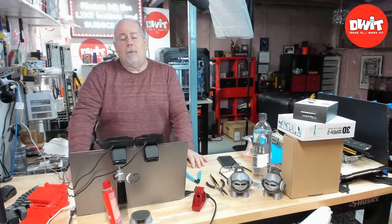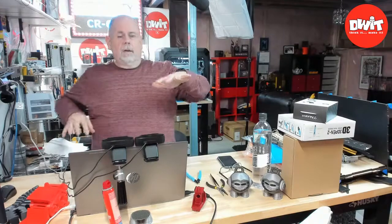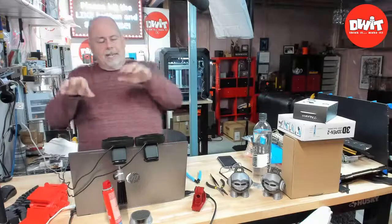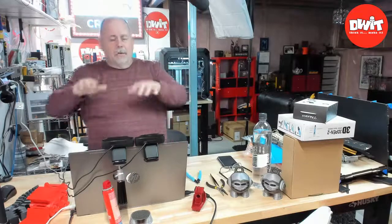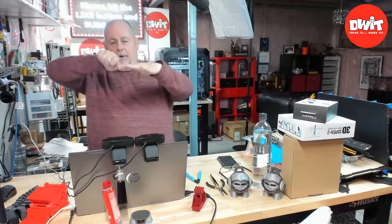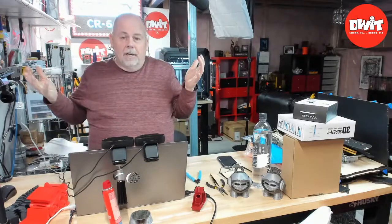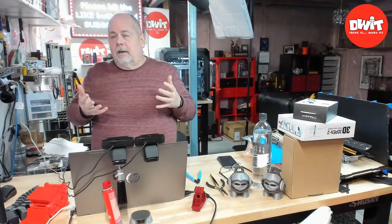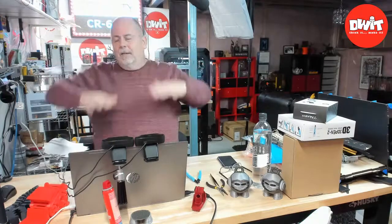What I'm having a problem with on the Ender 3 V2s is I have 3 of them at the office. One of them sticks beautifully, and when it cools off, I just pop everything right off. The second one sticks beautifully, and I have to pry them off a little bit. The third one sticks really well, but when it cools off, I have to put the scraper under and pry it off a little. So the 3 beds are acting differently, and they're all printing the exact same file, exact same slice. It could be that they're leveled a bit different. The Z offset could be a little bit different on them.